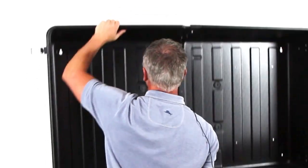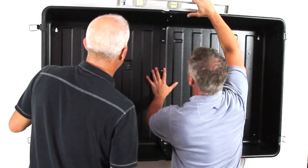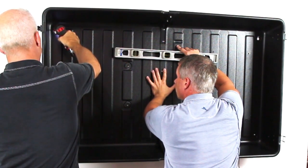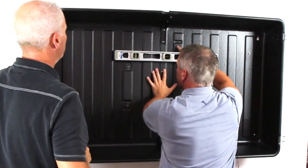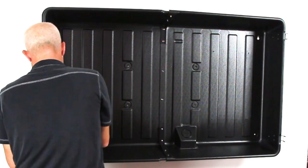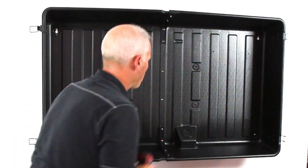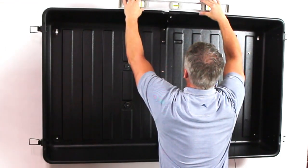Step 3: Lift the Storm Shell back onto the wall and position the S8 screw head into the top right keyhole. Place a bubble level on top of the Storm Shell back and rotate until it is level. Place a mark on the wall through the top left keyhole, making sure to mark at the center of the top where the screw will rest. Remove the Storm Shell back from the wall and check that the mark for the top left keyhole is centered on a stud. Repeat the procedure from step 2 to drill and screw an S8 screw for the top left keyhole. Mount the Storm Shell back on the wall using the mounted screws and the top left and right keyholes. Check that the Storm Shell back is level using the bubble level.